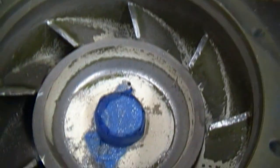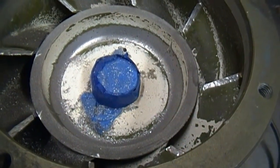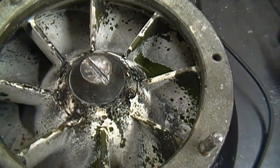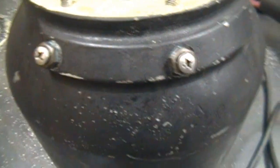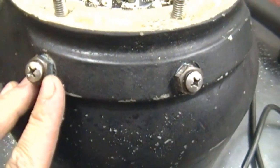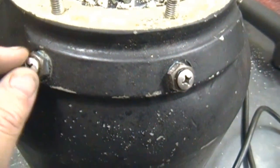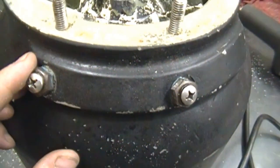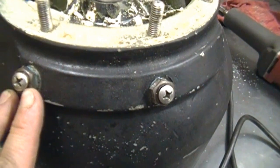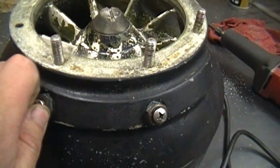You can see I had the oil passages in the bushings taped up — you don't want to be getting shavings in there. I also had the oil cap on the back. Another thing I did to this bowl: where you add the oil, I got rid of the original plug and got a stainless plug, drilled and tapped the center of it, so I have a screw. That way you're not constantly going in and out of those aluminum threads. Aluminum threads don't really last that long, so now I have steel-to-steel contact there.